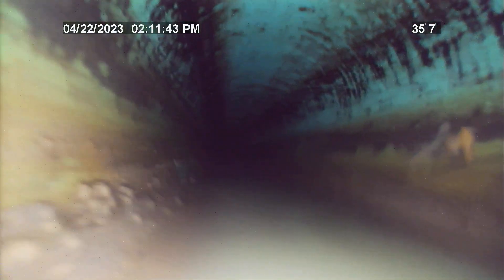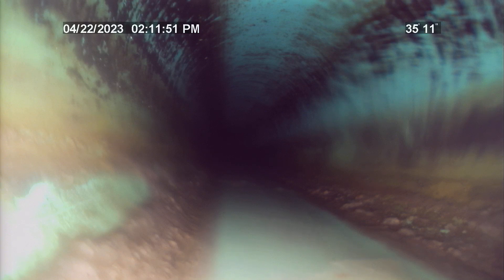While heading out to the septic tank, as soon as the camera gets into the sewer lateral it immediately is underwater. The camera comes out of the water at 35 feet, popping out in SDR 35 PVC.